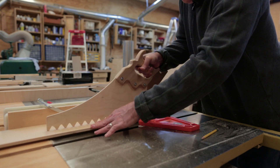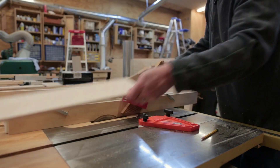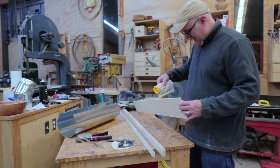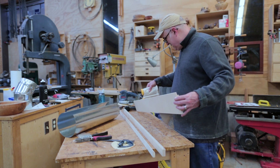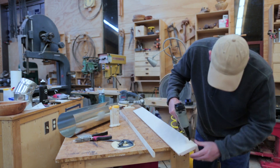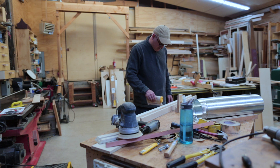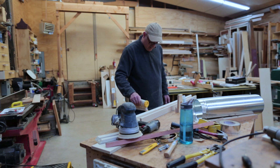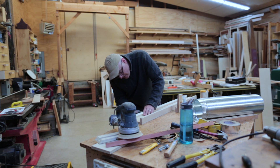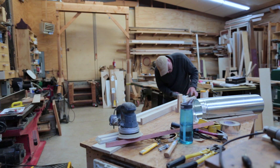The piece in the front is approximately three-quarters of an inch, and the piece in the back is approximately half an inch. I can glue those pieces into the rabbets, and the front face just needs some glue and a few nails. The cleat that I'll attach, I glued into place and nailed it both from the back and from the top, because it needs to be strong in tension, as the cleat will be pulling away from the wall.